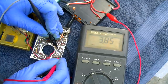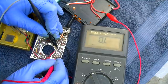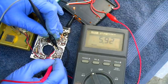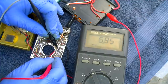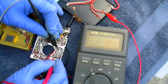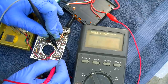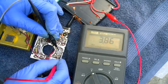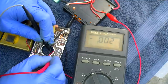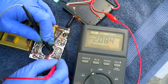They should be the same — 3.85 versus 5.94. Our supply voltage coming in is 5.92. How could the transistor side be higher? So the transistor on the right is definitely loading the transformer. Measuring across the transformer coils: 0 volts drop on one side and 2 volts drop on the other. Remember we're using a light bulb here, so we're not at full 9 volts — the light bulb is current limiting, so we only have 6 volts coming into the radio.